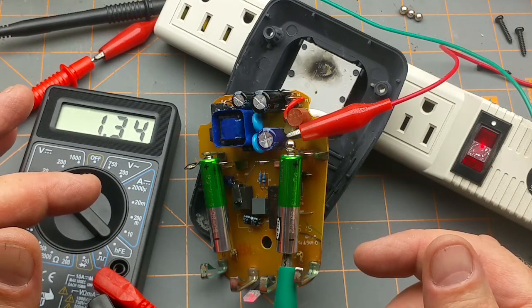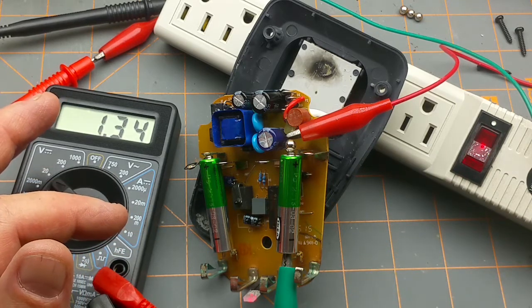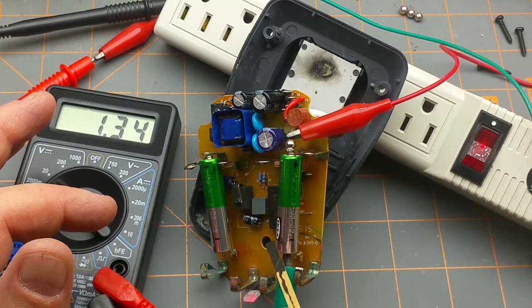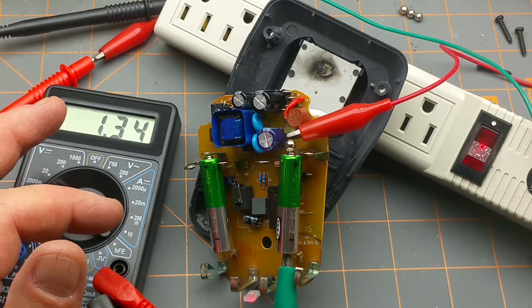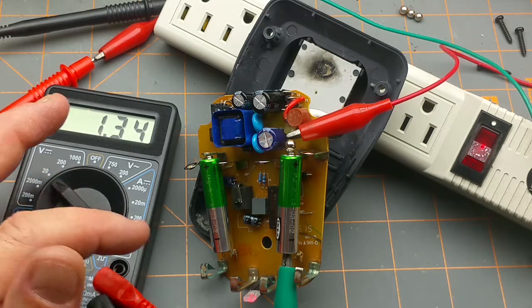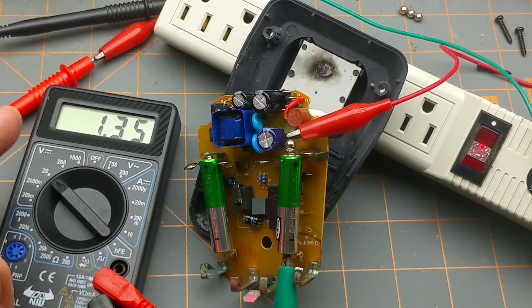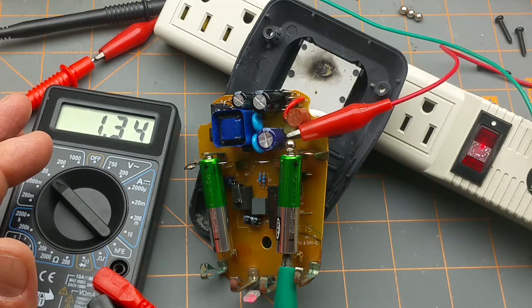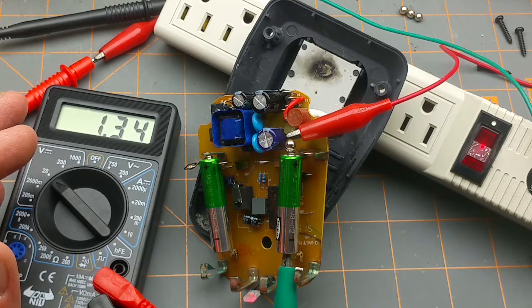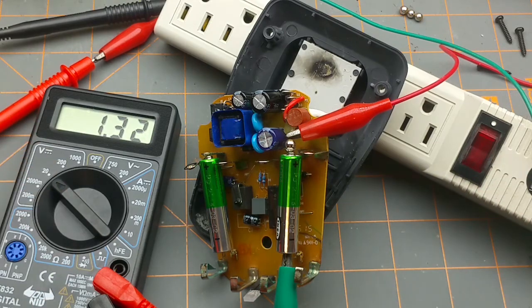Just because I've got this thing working again doesn't mean I'm going to put it back into service — that's just a janky little fix. It would probably work, but I wouldn't want to leave it running unattended. There's still a lot of corrosion on the back of the board; that corrosion has probably deposited dissolved copper in places that could be really dangerous. So I'm going to scrap that and go buy another charger — maybe from IKEA since these batteries are IKEA. I trust IKEA more than random Chinese manufacturers for something I'm actually plugging into AC power. Anyway, hope that was slightly interesting — I found it interesting. I'll talk to you later.